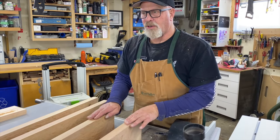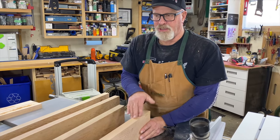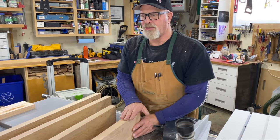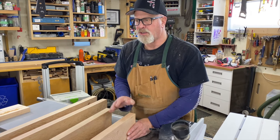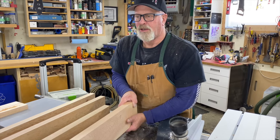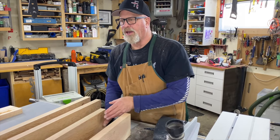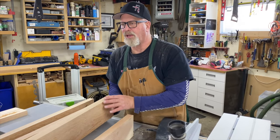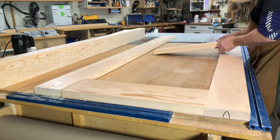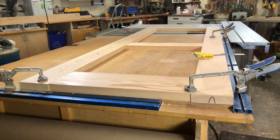Yeah, so these are the vertical stiles on the door, and these are going to be 82 inches long, roughly. This one here has a bit of a bow to it. So I'm going to pair the bowed piece with a straight one, and I'm going to make sure that I use this bowed stile for the hinge side, because the hinges will actually straighten out the curve. You don't want to have a curve, especially on double doors like what we're making, on the side where the door handle goes. I've used some other videos on YouTube as resources for this job, and I've put the links in the description of my video.